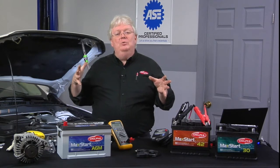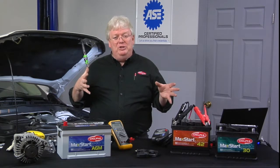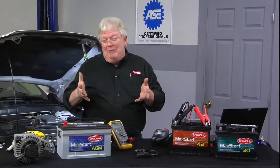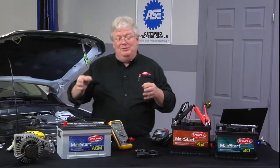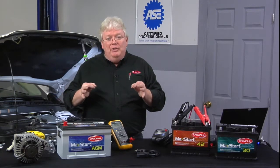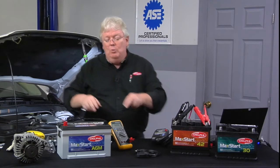Equate that to state of charge, which could be just a raw voltage number. Let's say in this picture I have a Delphi 12 volt battery that at state of charge is 100% — let's say it's 12.85 — and I have two 6 volt lantern batteries. Brand new off the shelf, actually measuring maybe 7 volts each open circuit, so two together in series is 14 volts — more voltage than this car battery.